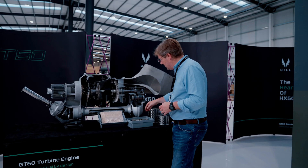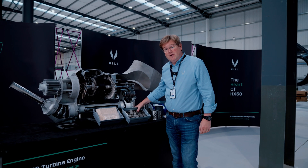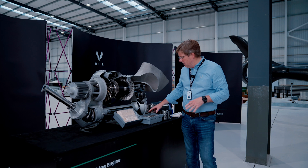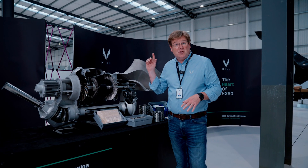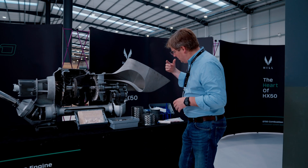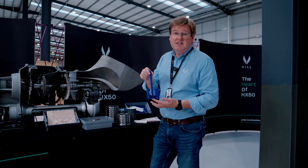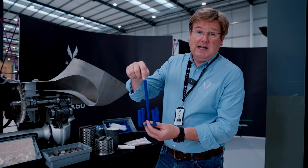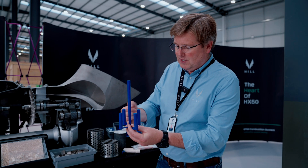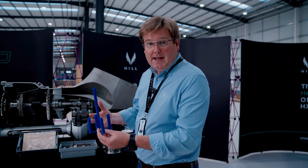What we're trying to do is melt raw super alloy materials — an advanced nickel-based super alloy that needs to withstand the searing temperatures within the engine. We melt that down in the new furnace we showed you last week and then pour it into a mold. To do that we have to develop a running system. This is a simple example: you pour liquid metal into the top, it runs down a central sprue, out through runners, and then fills from the bottom up to smoothly and orderly fill the blade cavities.